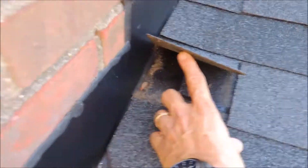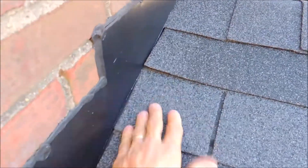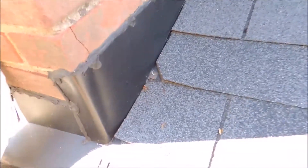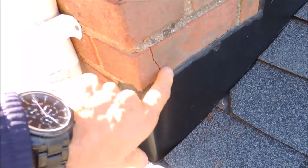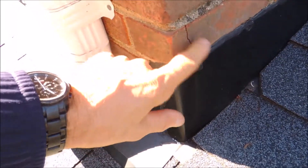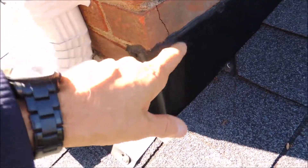Okay, here's a nail right here — like I said, that nail should not be exposed, it should be underneath this one. So we're going to take up the shingles along the wall here as well and we'll seal this crack in the concrete because the water can get inside here. And being that the flashing is nailed to the face of the bricks and not inside the mortar, this crack can cause a leak to go down inside the counter flashing.